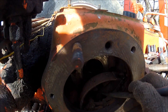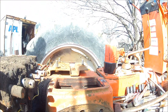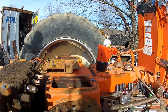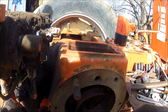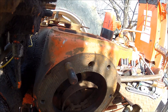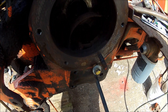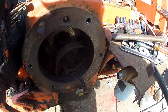On the other side I had to fight — thank you Jesus — several times getting that pin to move. I ended up heating this boss here and this boss right here with a torch to finally get it to move. When I put it back together I never-seized it to make sure this time when I take it apart it'll be okay. But someone obviously never greased them before putting this together last time. This thing's coming right apart — look at that pin moving. Thank you Jesus, them things can be a real battle.